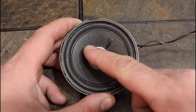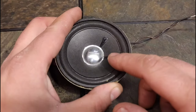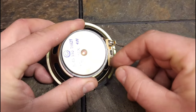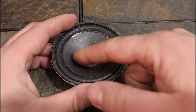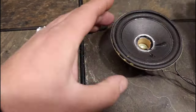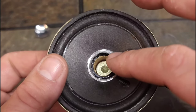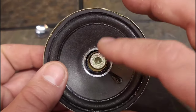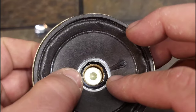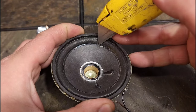To further demonstrate what actually goes on when a speaker blows, I'm going to take off this dust cover and see if we can get a look down inside the coil. If you ever notice, there are usually two kinds of wires — you always see these two marks. That is the leads coming straight from the wire, going down and coiling in a little coil, coming in one end and out the other. Here we can see the inside of the coil — the wire would be wrapped outside of this brown piece, which is the housing or shaft of the coil. That center piece doesn't move; the coil goes up and down over it.